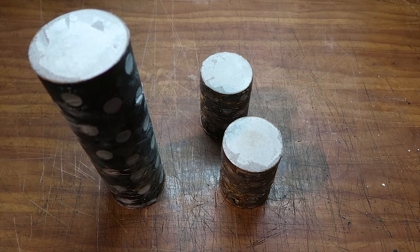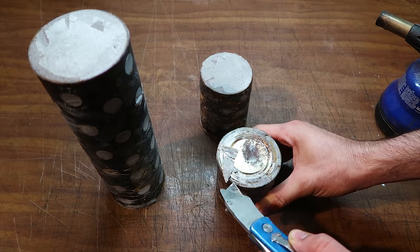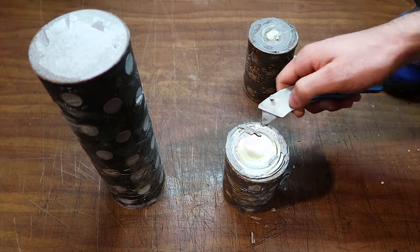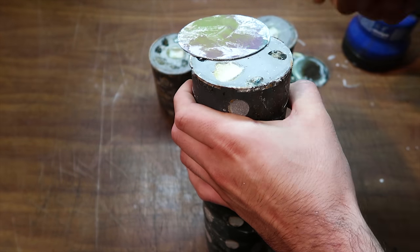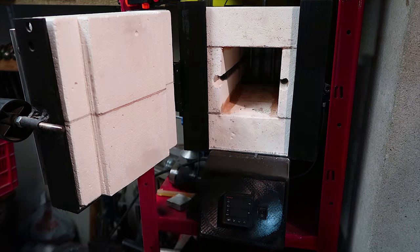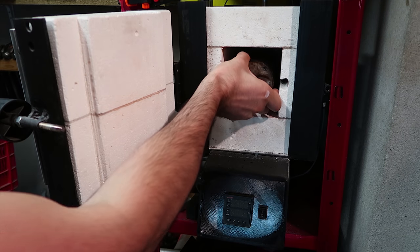After an hour, the flasks are solid and I remove the top steel cover. Since there's only hot glue holding this, they are very easy to remove with just a bit of heat. I let the flask dry at ambient temperature for a whole day to let most of the moisture evaporate out of the plaster without breaking it.